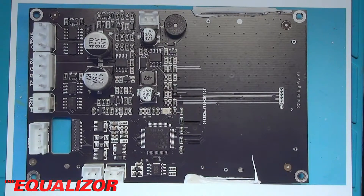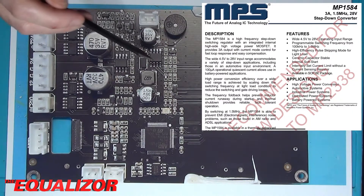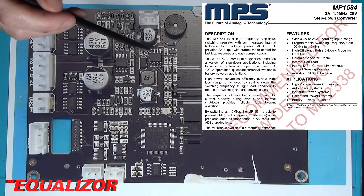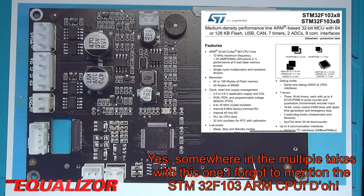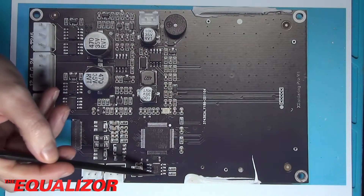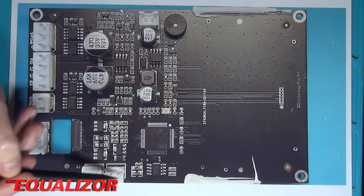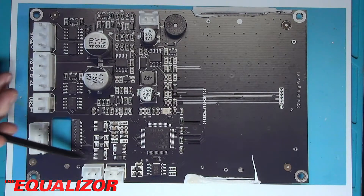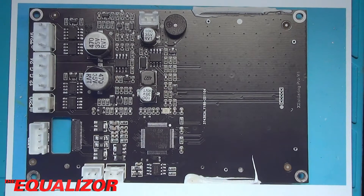The 15 volts from the power supply board comes into this header on here, and that then goes to the MP1584, which is a buck regulator. That will convert the 15 volts into something the microprocessor can use — normally 5 or 3.3 volts. Over here we have a 4884 N-channel MOSFET, and that is used to control the fan which plugs in over here. This connector over here is where the metal parts of the stand plug into, so that it can tell when the irons are back in their holders.